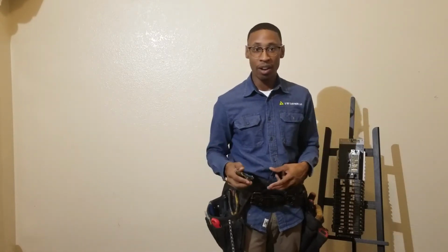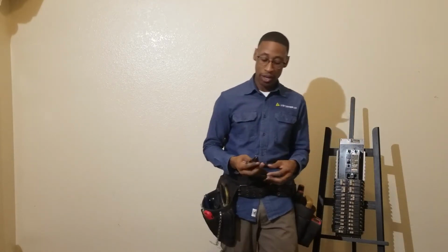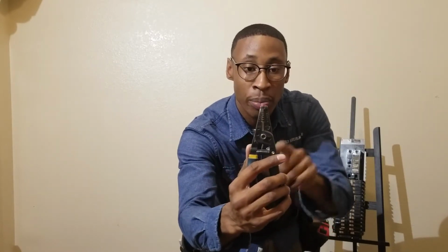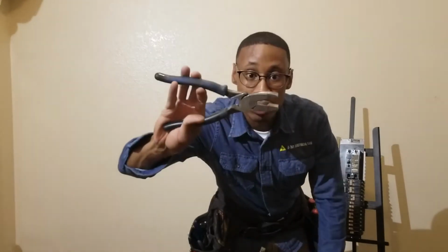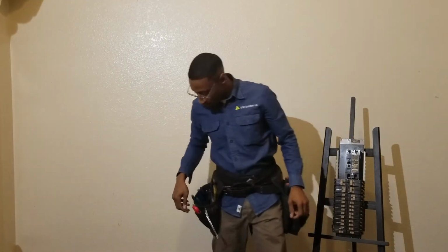When they bring that wire out, it's wrapped in insulation. It's not going to be just brought out bare. So you do need a tool to strip the insulation off. So these are the strippers right here. If you look real quickly, you can see those holes. Each hole represents a different size wire. So you put your size wire in that specific hole, about 1 inch in there, and you strip it. And then you'll see your bare copper. Then you can take these tools, this lineman or Klein, and twist those 2 wires together once you strip the insulation off.